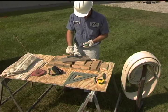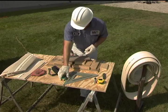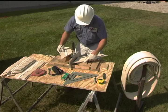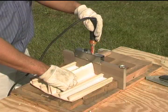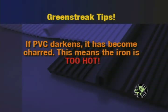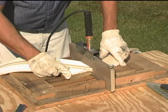It is common practice to start with the iron on the hottest setting, and then turn it down if you find that it is too hot. If you do not have a digital pyrometer available, you will have to use good judgment to determine whether the iron has heated to the appropriate temperature. Simply take a piece of PVC water stop and hold it directly on the face of the iron. If it appears that the water stop is melting within 20 or 30 seconds, the iron should be hot enough for welding. Green Streak PVC water stop should not significantly darken when melted. If it has, it is an indication the welding iron is too hot and the water stop has been charred. Once the iron is at the correct temperature, you are ready to start welding.